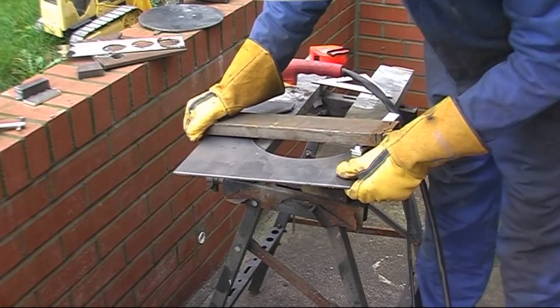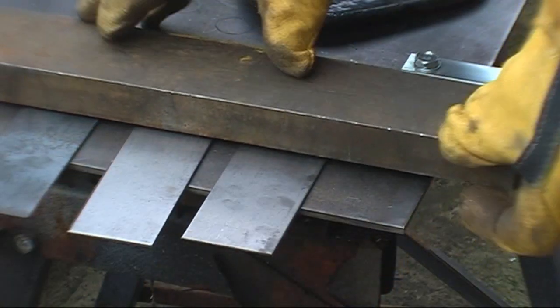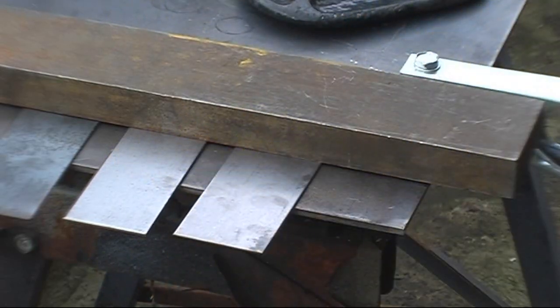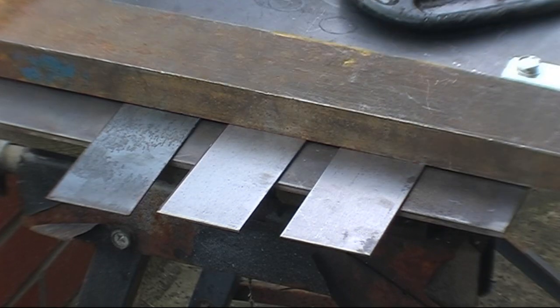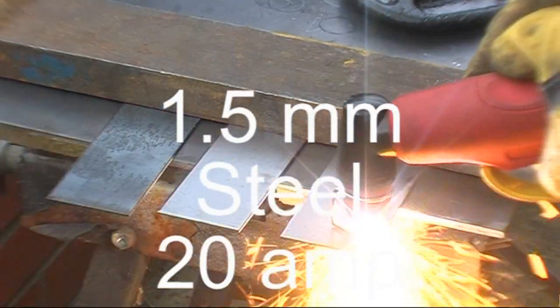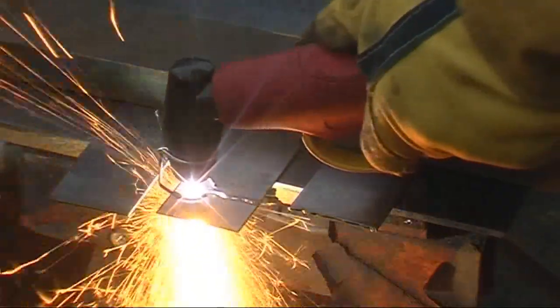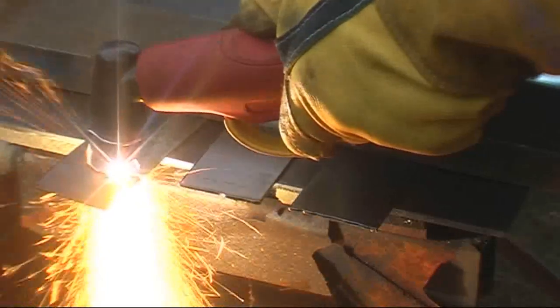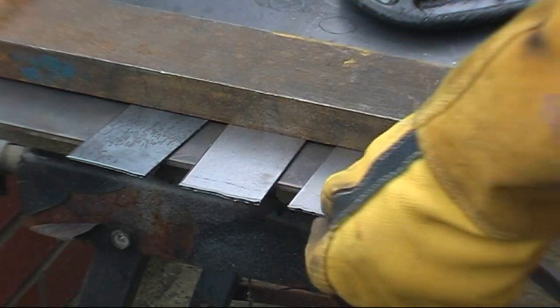That's excellent. It's a 1.5mm sheet, making an interrupted cut into a cutting mesh, and I've got it down to 30 amps. You can go ahead and get through it no problem.